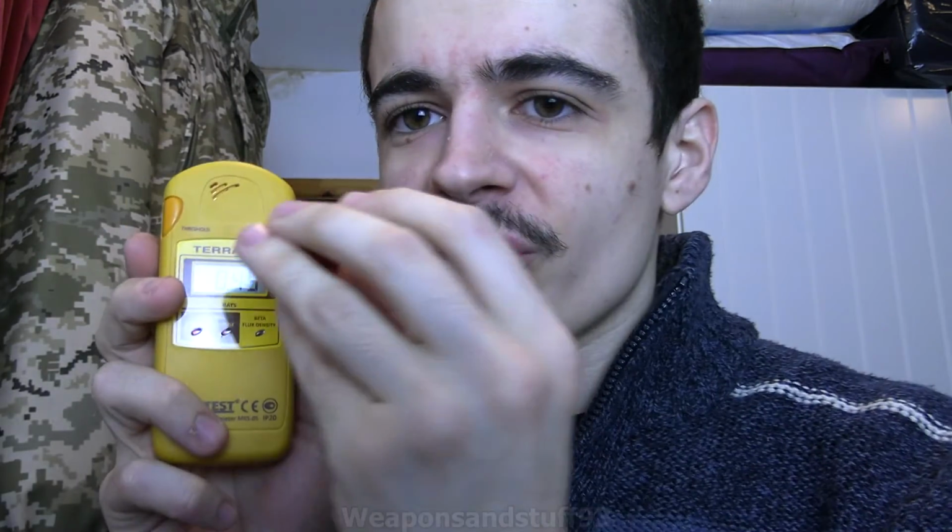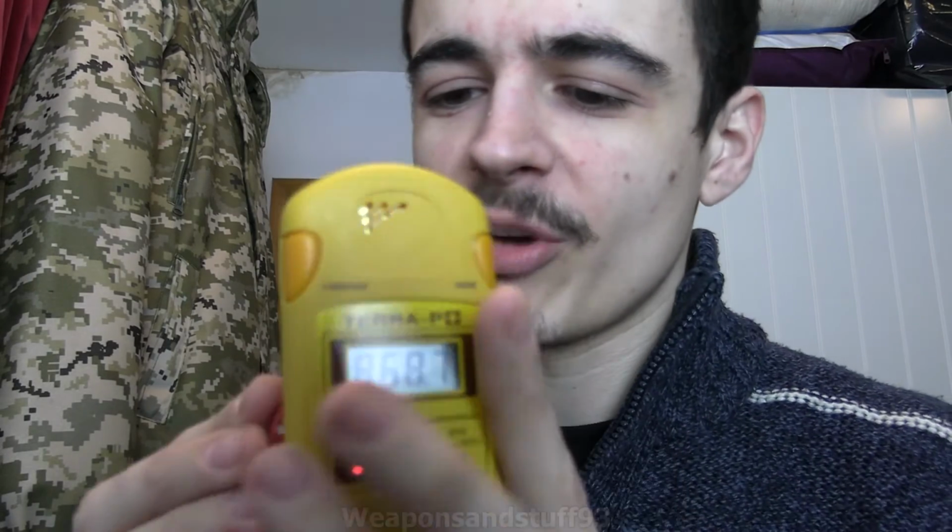So there you go, that's that, and I want to show you how good the shielding is on this as well before I forget. Okay, so what we've got here is the really strong little bit of strontium-90. And what I want to see is what reading this goes up to, and then we'll see what the beta flux density says. But regarding shielding, what you'll notice is if I'm holding the strontium-90 across most of this dosimeter, it's not getting readings from it, right? It's only when I get it to where the beta tube is, oh, there we go, with the beta shield open, that it takes readings. So it's actually a properly shielded Geiger counter. Shielded is the important part.